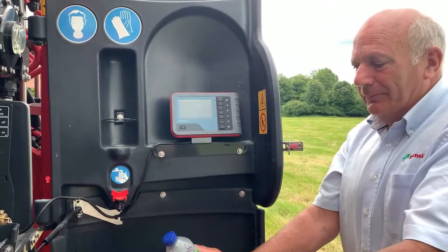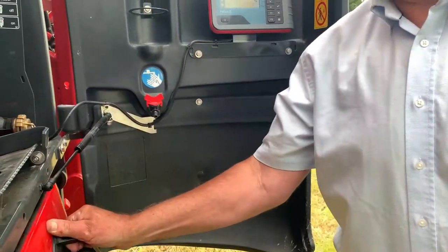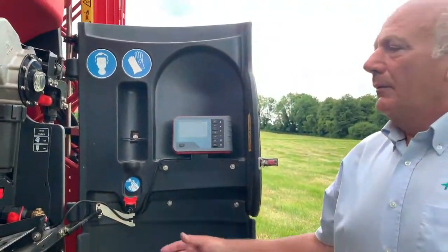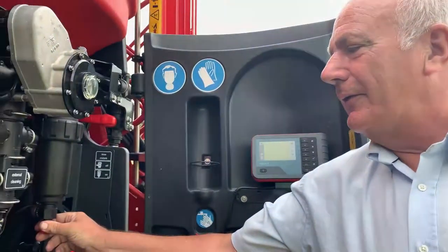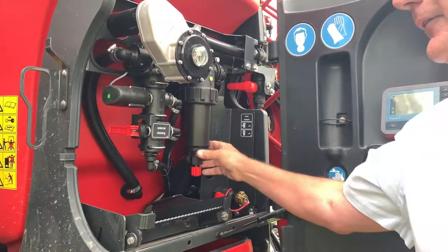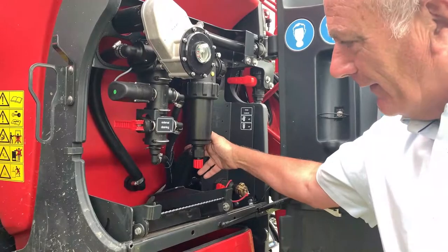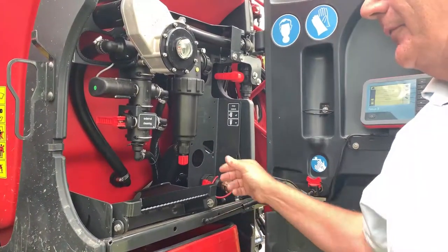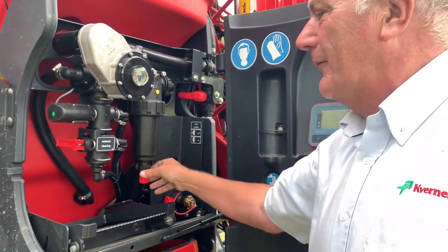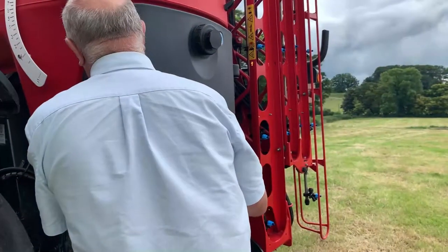The chemical inductor, as with all chemical inductors, has rinsing and wash capability. For storage, underneath the filter on the pressure filter here, we've got a continuous wash - by opening this valve at the bottom we can keep water going across the filter, helping to keep it clean. It takes it back inside the tank by a valve here, and then it's picked up again by the suction filter, so it just enables more liquid washing the filter elements all of the time.